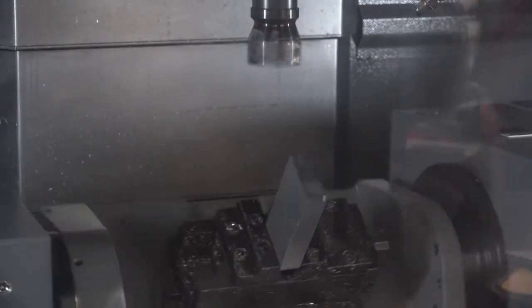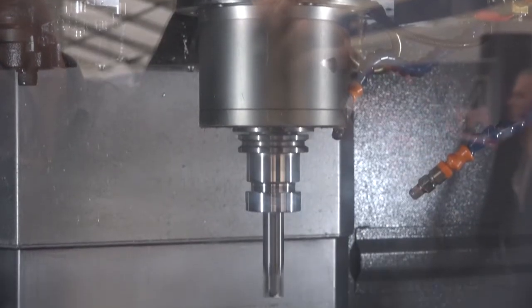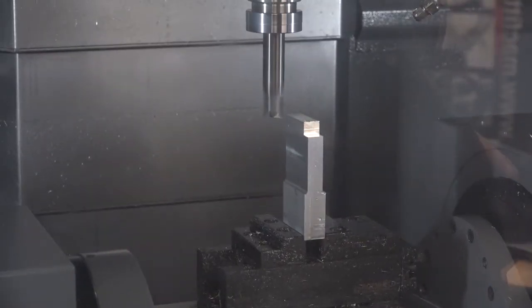The VM10 is a very small three-axis machine, and this is just an extension of that with a change of configuration. It's a very similar design — along the same lines with a 10,000 RPM spindle, a 20-station swing-arm tool changer, and rapids of around about 20 meters per minute. So it's within the same sort of envelope as a VM10 three-axis machine. There's always the common discussion about three-plus-two machining, five-axis machining, four-plus-one.